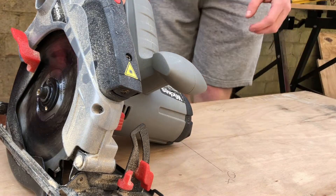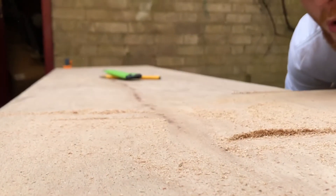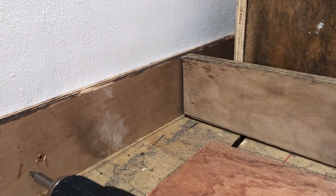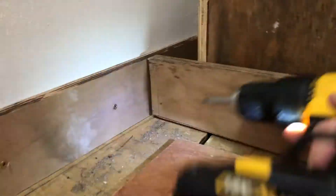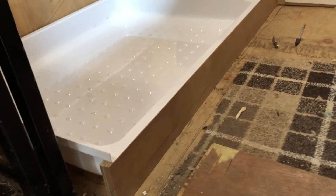Whilst Megan was painting the wall I started on the base of the shower tray. I chopped up three lengths of plywood — two being the length of the tray and the other at the bottom of the wall, adding sturdiness as well as the 18mm base to the end of the tray, all at the same height. I then screwed the rest of the wall in, with the bottom already screwed in and the top screwed into the cabinets. I also added right-angle brackets around the base plywood pieces and to the side and floor of the van for extra sturdiness.